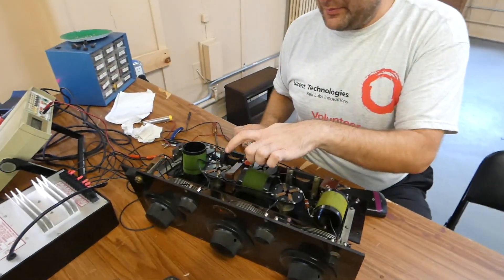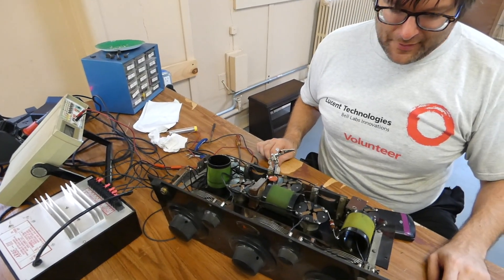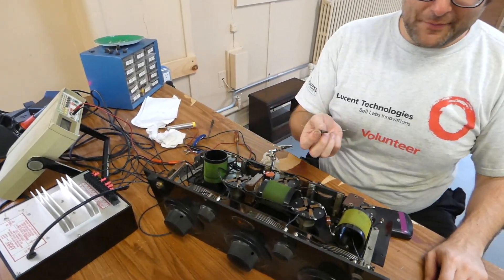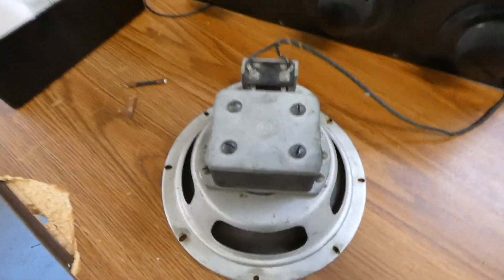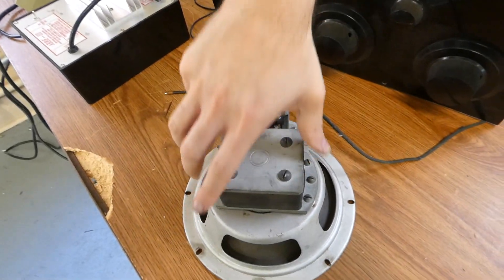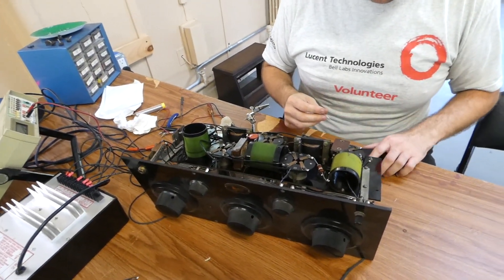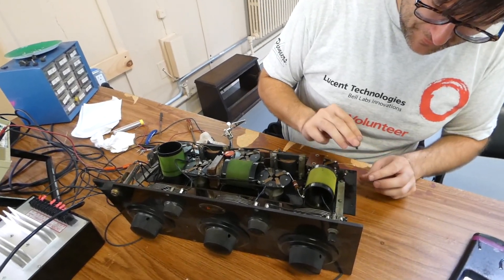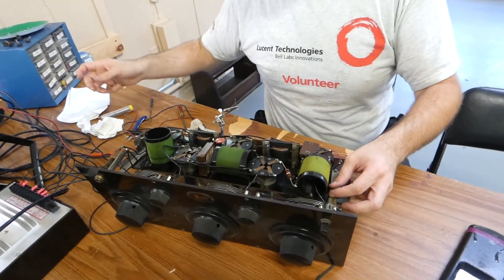There are bad grid leak resistors in it. I replaced one capacitor, and right now I'm bypassing the other grid leak, but I'm going to try to leave the old one on the connector. You're using this fine reproducer here — seen better days, but it should be a high-impedance speaker. So with any luck, we might be able to make a crackle. Oh, that'd be cool.